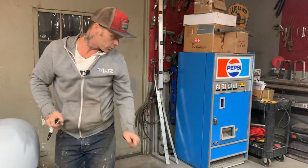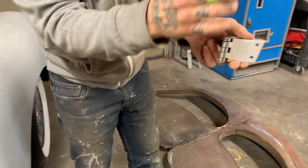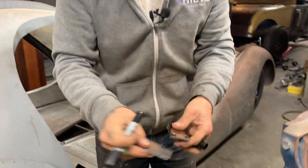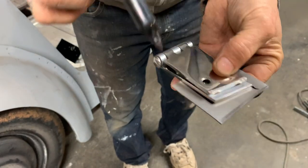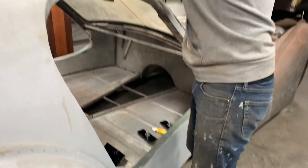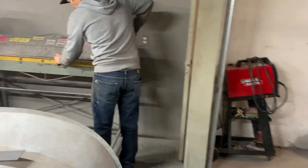It's a good thing I put the doors down — now I know I've got them both together. The hinge is a certain width, and when I put it up against the door and try to slide it in, there's not enough gap. So what I have to do is French it. I took a piece of metal like this, and I know how wide that piece has to be bent by marking it. I can see that. So I took this over to the brake — or I could use my Gene Winfield table and bend it over, vice grip it. But since I have the tool, I'm going to use it.